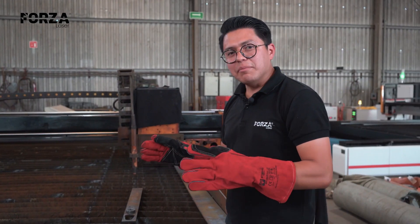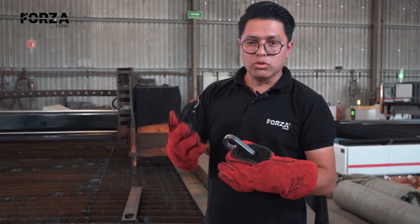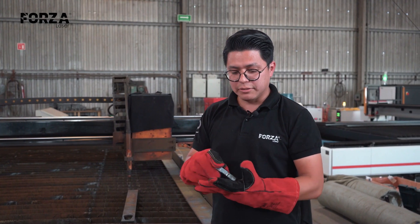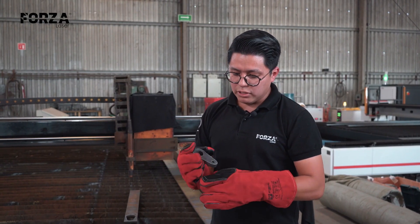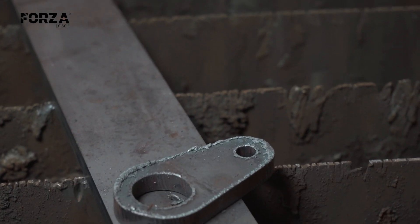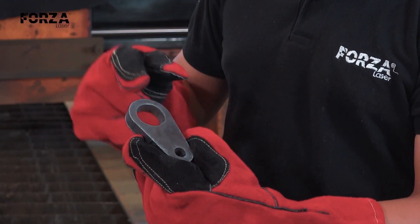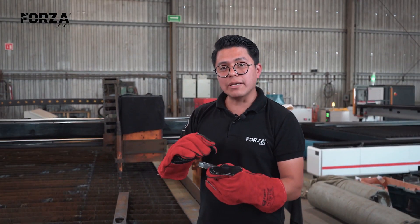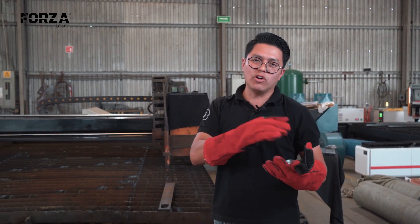Let's take the piece and look at the first results. The first thing I had to do was wear heat-resistant gloves, since the plasma cutting process generates intense heat on the metal. That's already a first disadvantage — this level of heat tends to temper the material, which can affect its properties for future use. Looking at the cut, we can clearly see a lot of slag left on the edge, as well as visible cutting lines that are not very clean. And if we focus on the circular shapes, they're not perfectly defined — there's even a slight bevel on the edge, something we won't see when we check the laser cut in a moment. So now we're going to proceed with the test using the fiber laser.